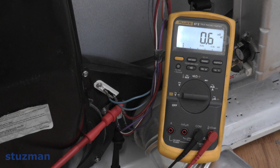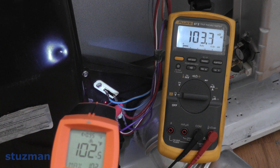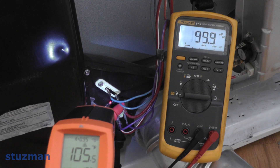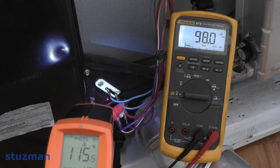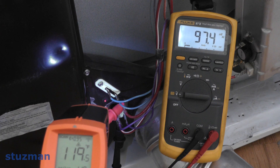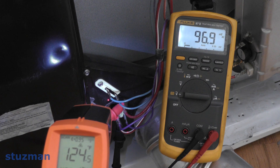So right now we're going to get it started up. We're going to take the IR gun and monitor that thermostat — we're going to be looking at this heat. Right now we've got 100 millivolts across this thermostat contact. It is closed right now and I'm looking for it to open around 155 degrees, then re-close again 25 degrees less at 130. When we see the voltmeter rise up to around 240 volts AC, we know that's when the contact had opened. We're monitoring both the voltmeter and the temperature to see when all that happens.